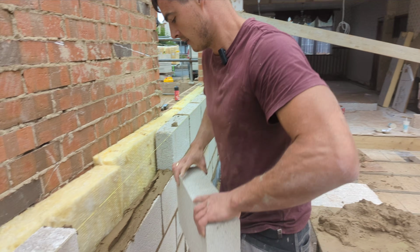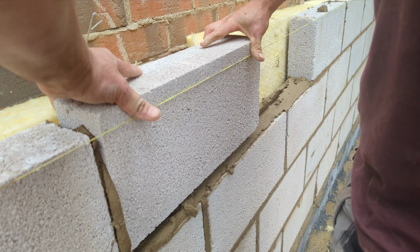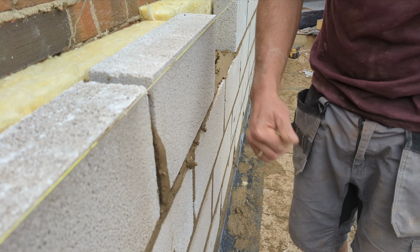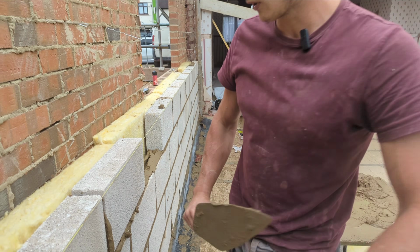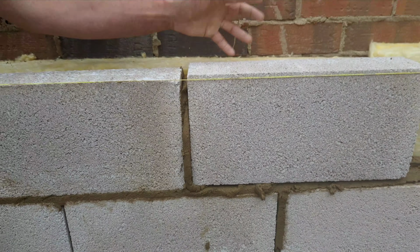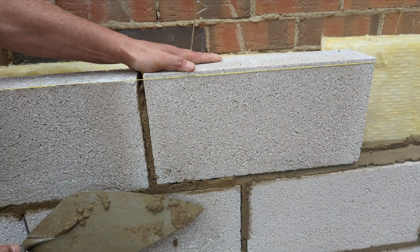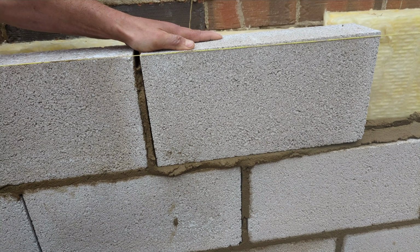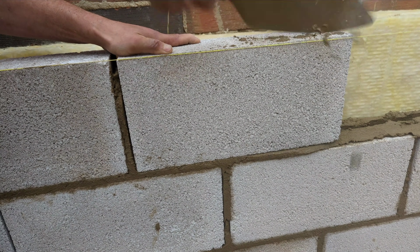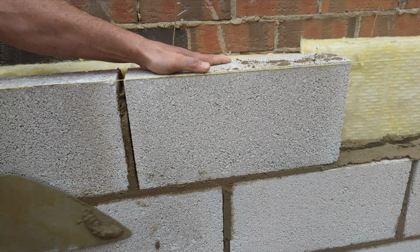So, right, block goes up, thumbs go out, okay? So, there we go. I'm slightly high from the line, but I can see that my face plane's pretty good. All I'm gonna do is just literally, my hand is on the back of the block. I can see what I need to do, okay? I need to bring this out to there. I'm literally wiggling. There you go, just did it. There you go, it's all in this little twist here.